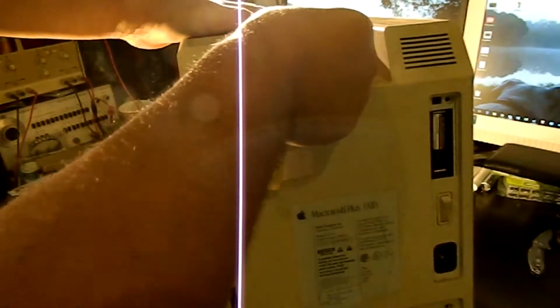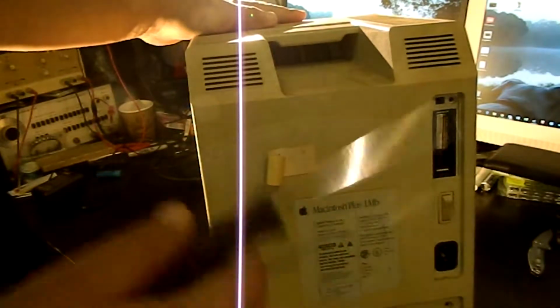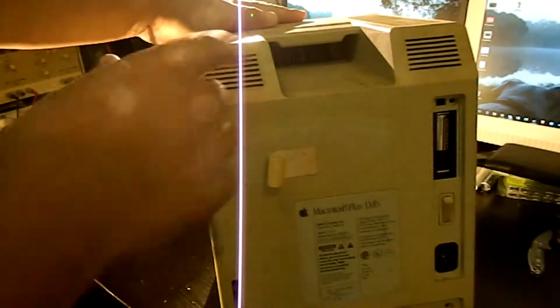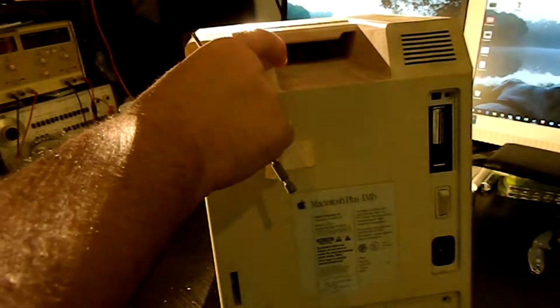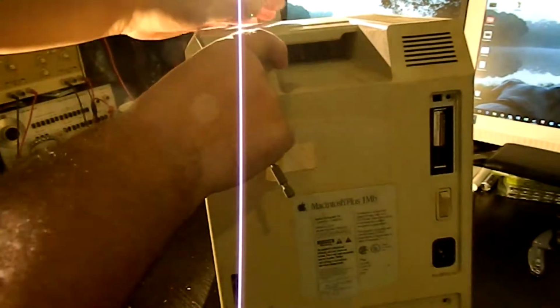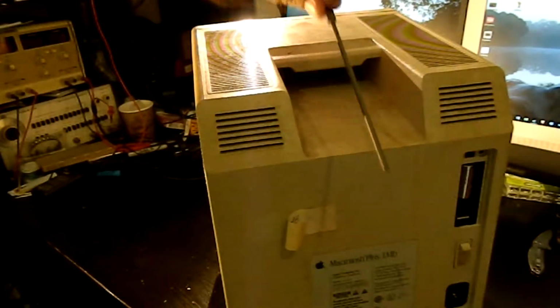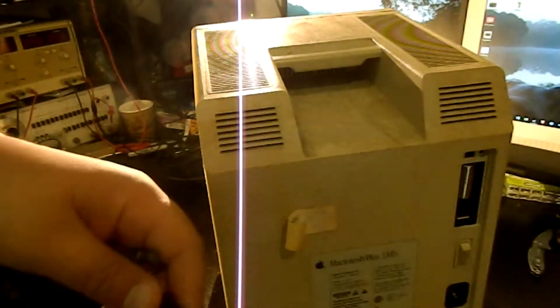is 2 screws very deeply recessed up here. And the reason that I didn't take this apart on the previous video is precisely because I don't have a driver that will fit deep enough. And you can't use an adapter on the end of a multi-purpose screwdriver because as soon as you get a little ways inside here, you find that the screws are behind very, very narrow holes and you need a very thin driver to get in. So, I bought this 6-inch T15 driver. And even with this, I need an extension to be able to use it properly.